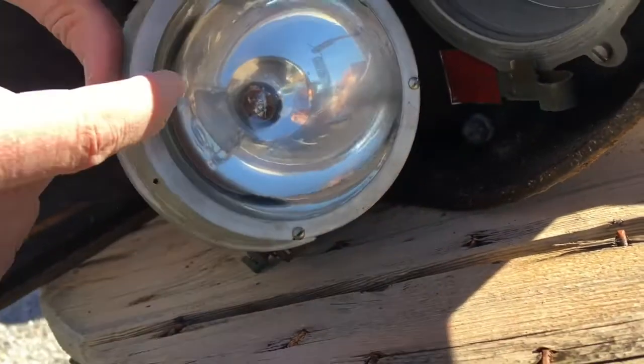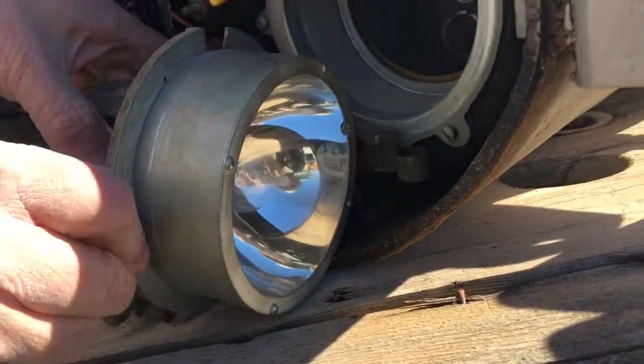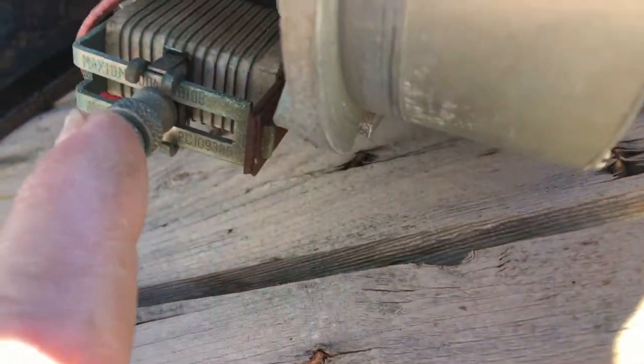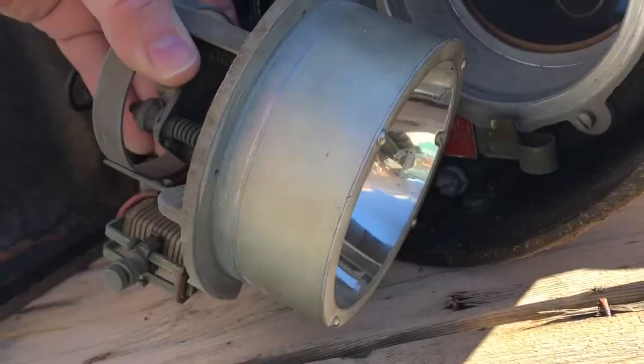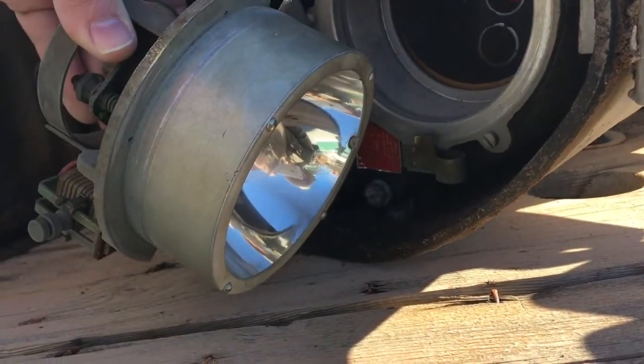And this bulb is a signal bulb. It's 12 volt. It's actually technically 10 volt. And then that's what this rheostat is for. This is so you can adjust the brightness of the bulb. Wow, look at that right there. Yeah, you adjust that, and depending on where you hit it on the coil, you can change the voltage of the bulb so you get just the right voltage. You don't need to worry about it for what you're doing. Sure. But for the railroad, they need it to be in spec.